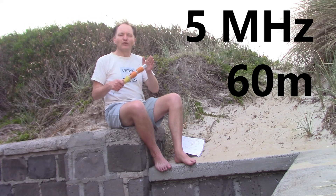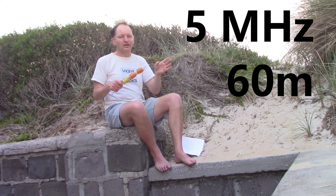Going up a bit to 5 megahertz, a band that we don't have in Australia but you do in a lot of overseas countries. There, 15 metres of wire becomes pretty close to a quarter wavelength. So everything I discussed in the previous video about 20 metres of wire being used on 80 metres as a quarter wavelength applies for 15 metres of wire on 5 megahertz or 60 metres. It will be low impedance. You may be able to connect it straight into the antenna socket of a transceiver, particularly if it's got an inbuilt antenna coupler, but otherwise a small matching network and some radials will help it work efficiently on 5 megahertz.